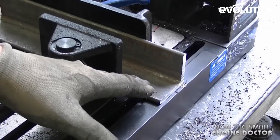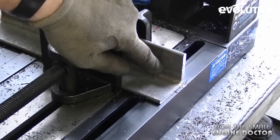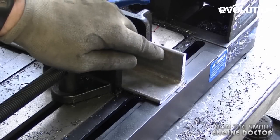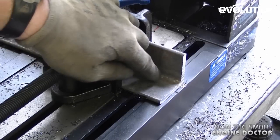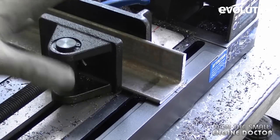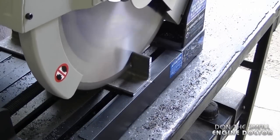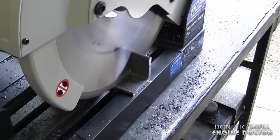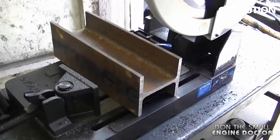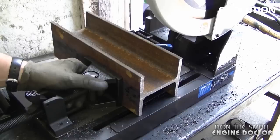And I'm going to cut another one in this angle iron. When I use my abrasive discs, what I do is I cut through this piece first, and then I flip the metal piece back up because it's easier with the abrasive disc to cut from the top down instead of just cutting flat like this. But I've noticed that this saw here goes through the flat part with ease. Now it's time for the big piece, and I'm curious to see how that's going to make out.